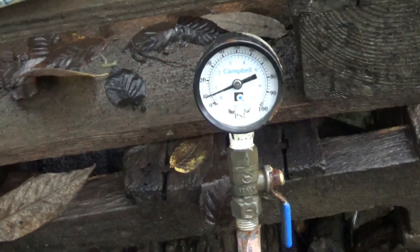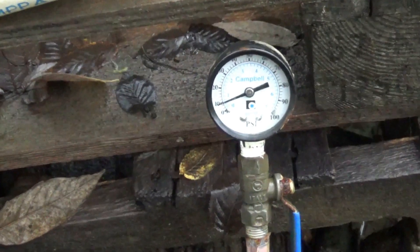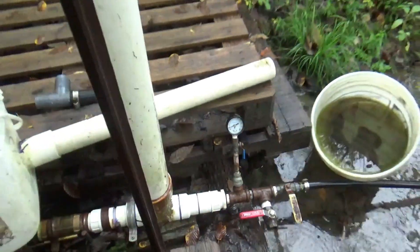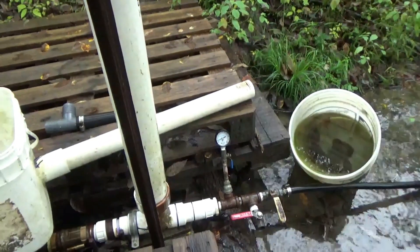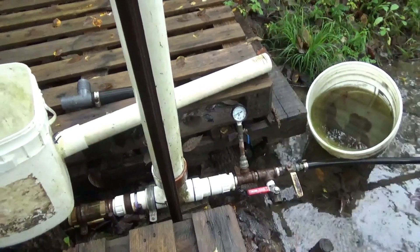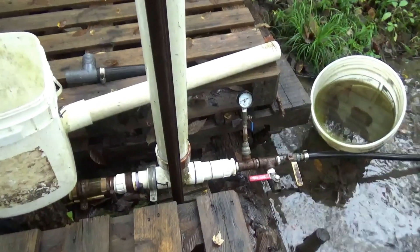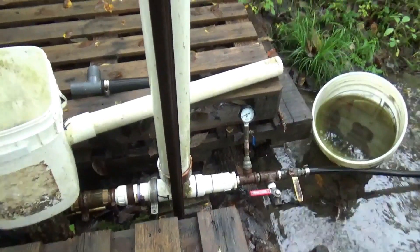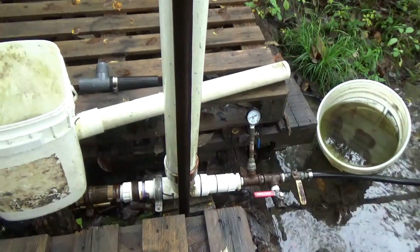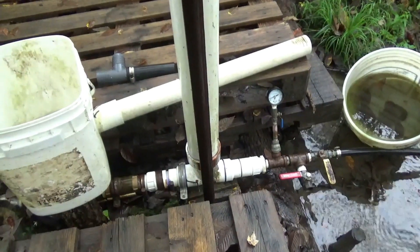Based on that, I knew I had to go about 20 vertical feet above the pump. I'll show you where the leak was and where the temporary repair is. I'll walk up with the camera and speed the shot up so you can see how far along the delivery line that 20 vertical feet actually is. This might not be a pressure chamber issue — it could be in the delivery line itself.